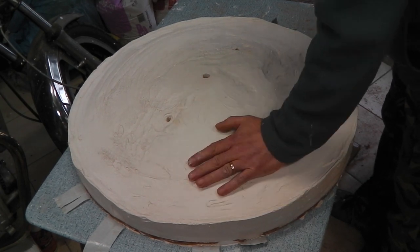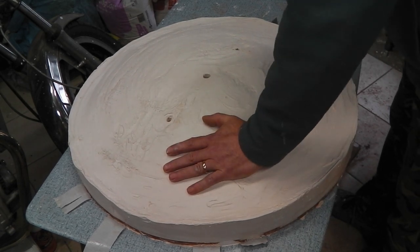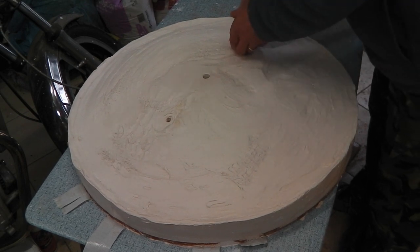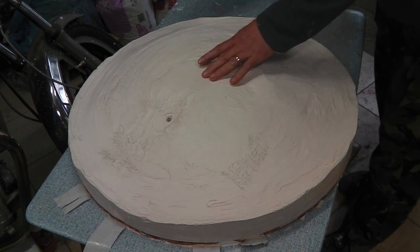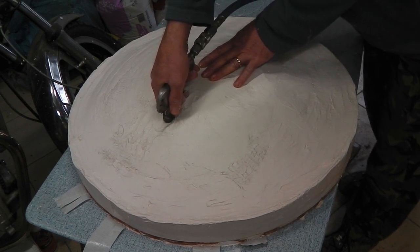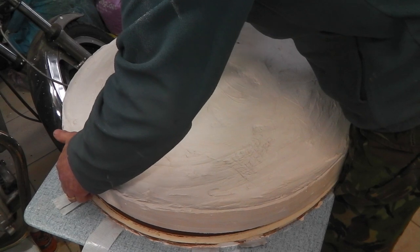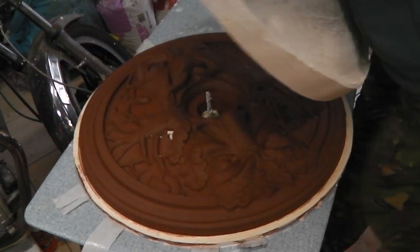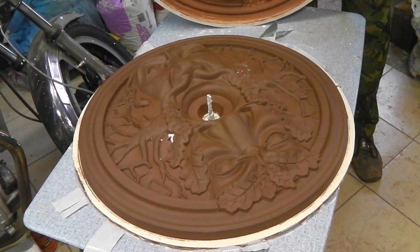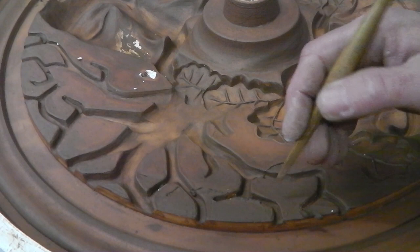No release agent between the clay and the plaster of Paris — the idea being the wet plaster of Paris will soften up the clay underneath so there's nothing for it to bond on to. Try these holes and this should help release the middle. That's shifting — it's also blowing out of these other holes. I can feel it lifting up. And we're off — beautiful. Just one little bit where I put the hole in that I've got to repair on the mould.